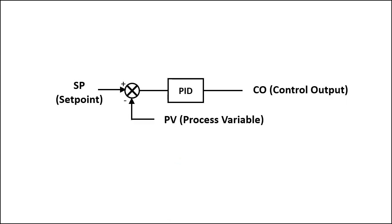I'm assuming you are familiar with the PID feedback process where you tell the drive you want it to be at some value we call the set point. It monitors the system pressure via the process variable, takes the difference between the two, and uses that error signal to figure out how to adjust the control output. We can also bypass the PID calculations and manually drive the output, which helps us test the system.